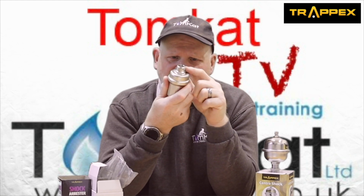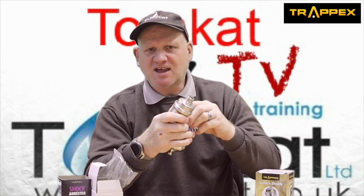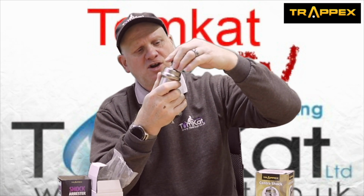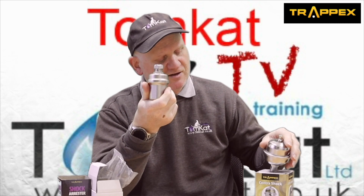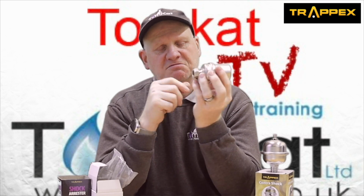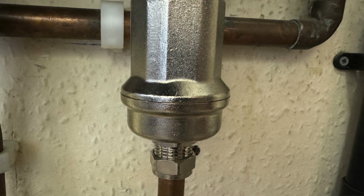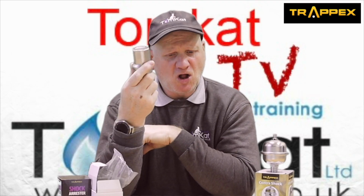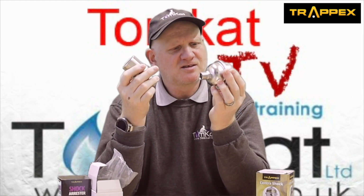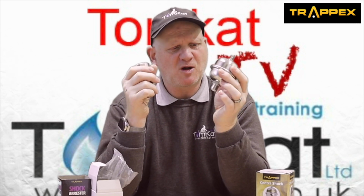And again, this one has the same thread on the bottom. Again, it's 1/2 inch BSP, and again, you can put a nut and olive on there, so you don't have to have a bulky male iron to copper connector on there. It just looks a lot neater. So this really is a no-brainer for me. I'd fit them all day long, because again, it's just going to be over 20 quid rather than these, which people don't really know how to set up properly.